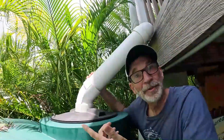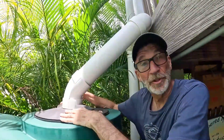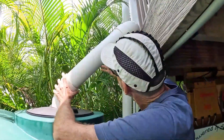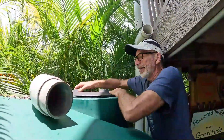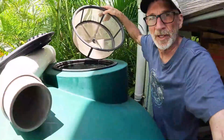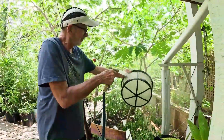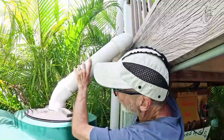After the first flush, the water comes right on down and enters the tank at the top. There's a third filter right in here — it's another particle filter. I leave these top pipes loose so they can come off pretty easily and provide access. You can see that the tank is completely full. That's a pretty fine mesh particle filter. We're going to rinse this off and put it back in place — the screen's all clean, and it just pops right back in. Now we're ready for collection.